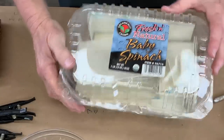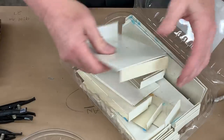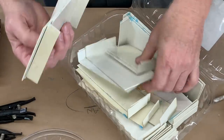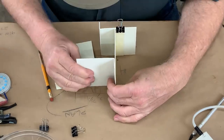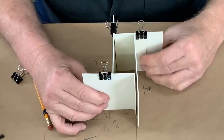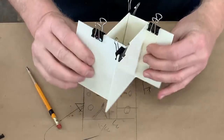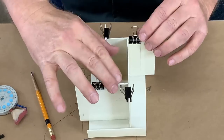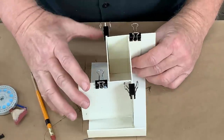Break out the old fresh-and-natural baby spinach box — what's in it are mold cases. These are just pieces of bent styrene that I hoard. They go together something like this, and you tack them together. This system is not the highest precision system in the world, but it works. The trick is to get it reasonably square and tightly sealed so that it doesn't leak.